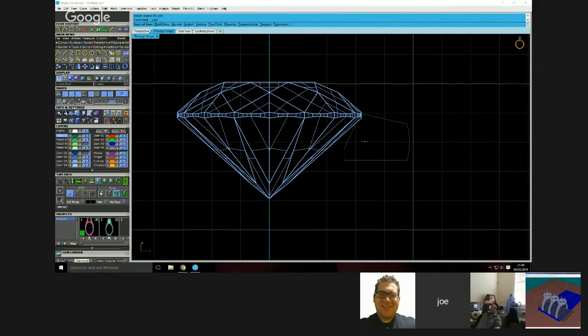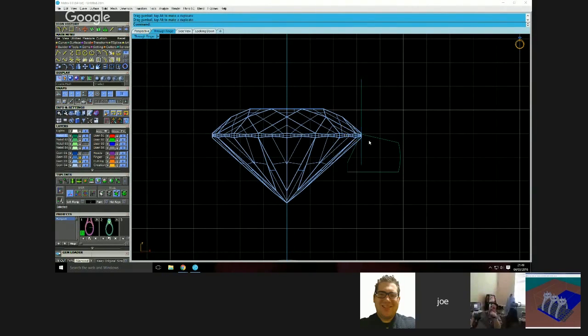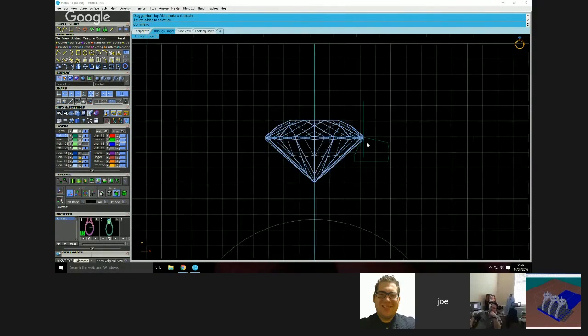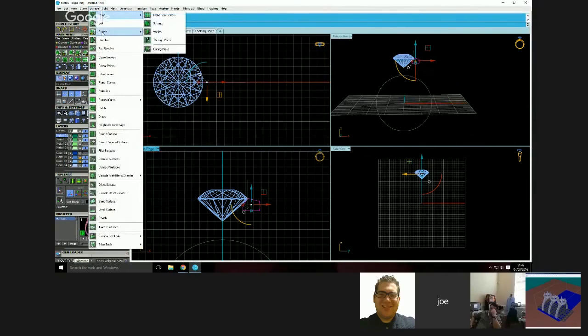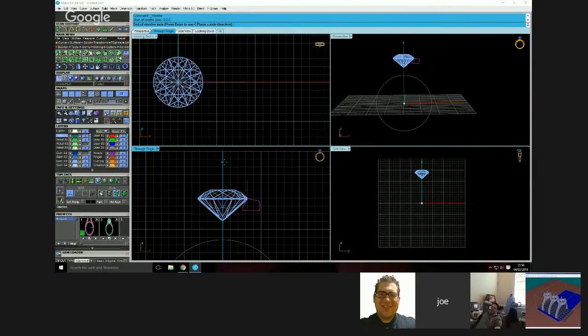We want a prong, so basically longer than that maybe. We've got two splines on now, we don't need to have that on. Something like that. Prong, middle of the prong goes to the end of the stone-ish. And then if I get those two and group them, I want to put them together to join them. So it's unable to, so again it just wants projecting to the C-plane. And then it'll join one closed curve, and then with that, just do surface revolve from F4 straight up.